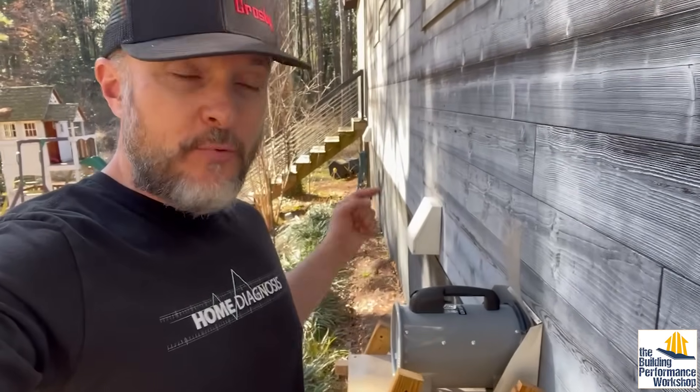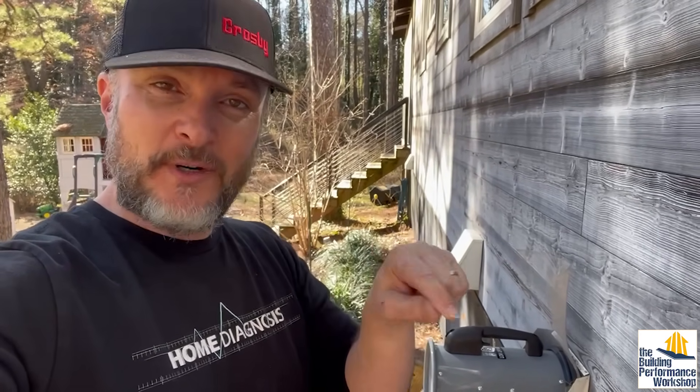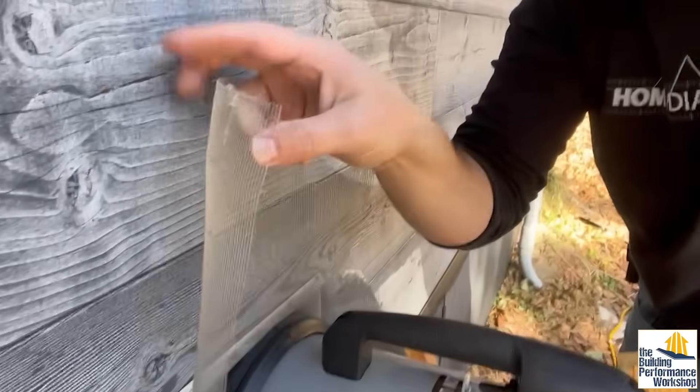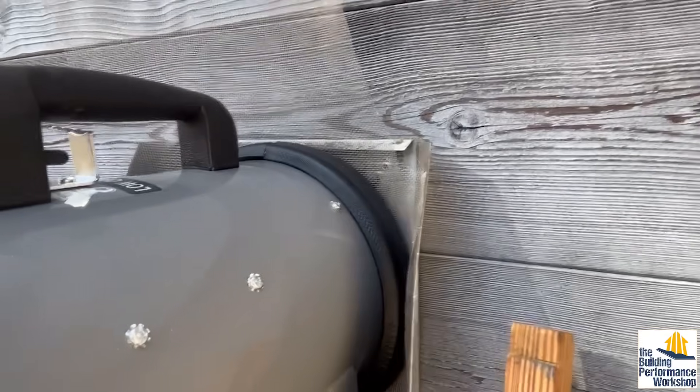Why are we vacuuming instead of pushing the dust out of the house? I want to pull from here because if there are any leakage points — which there are, because I've fiddled with this ERV ducting and unsealed some of the seams — if I pressurize the duct that blows the dust out inside the house, and I don't want that. So I have the fan out here with the airflow going out of the house, with this screen in place and the weather stripping pushed up tight against the house.